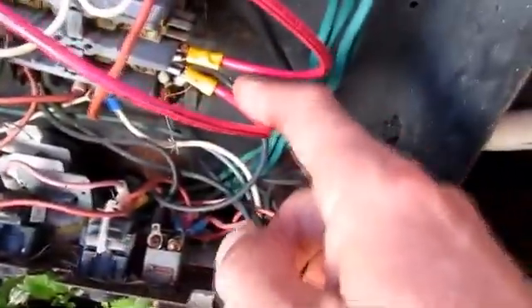I put in two wires, and on this relay you can see I've got plenty of contacts — I left quite a few of them there — so it was easy to just build up one wire at a time, and each wire is going to have its own terminal, not like the green wires where I twisted them together.